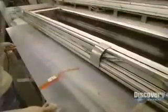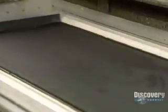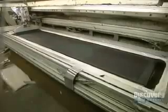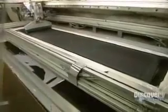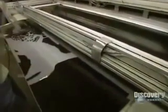As for the top part of the board, it's made of a resistant plastic applied by silk screening. In silk screening, ink is spread by this little squeegee. This application is called a pass. Colors have to be applied one at a time. The inks must dry for several hours between each coat.